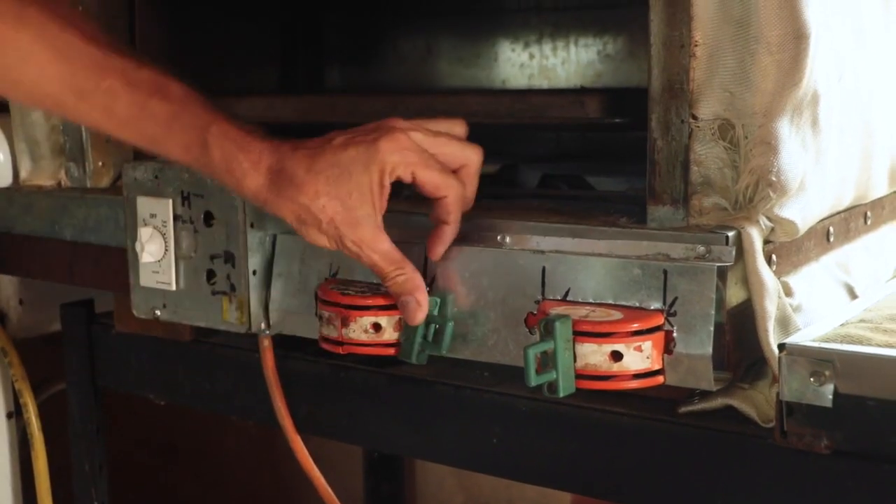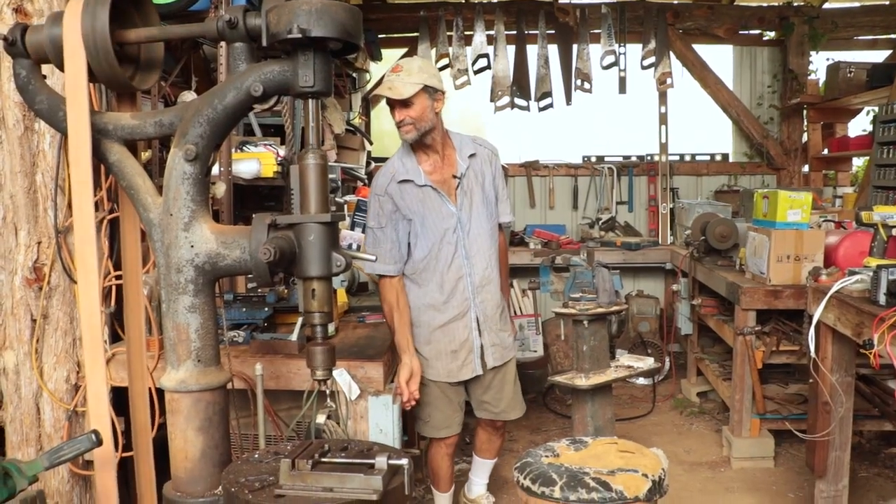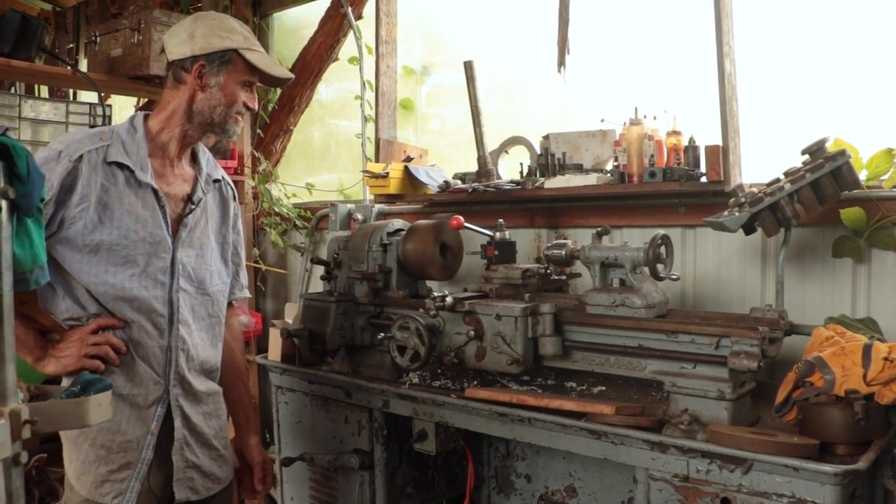Here's the interesting thing. With a 100 watt, 12 volt cooker, when it gets even moderately cloudy, you're shut down. Our biggest cooker is tied into our high voltage system. At Living Energy Farm, our high voltage system runs dozens of motors as well as our cookers, heats the houses, does a lot of different things — and that runs at 180 volts. At 180 volts DC, we can cook when it's cloudy — not heavy overcast, but mild overcast, partly cloudy, we can still cook. That's pretty amazing, and it's because of the integration of that DC microgrid.